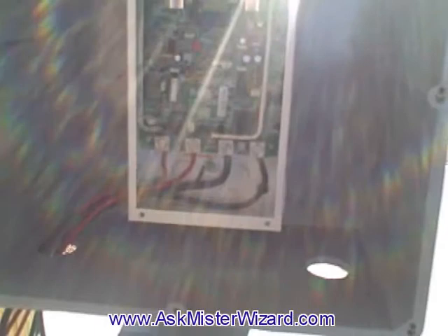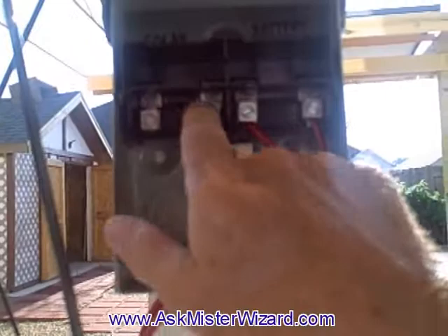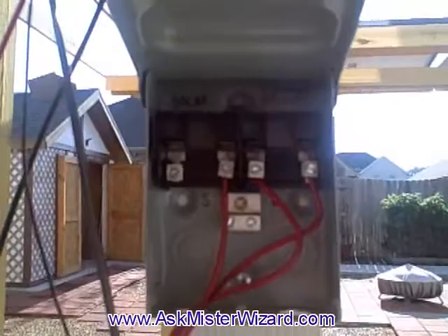Five minutes later, one more wire added and we're almost done. I just added this wire, which goes down to this side of the fuse, so we're going to be ready to route energy from the solar panel through the fuse and back up into the charge controller. With the fuses removed, there's no connection, so I think I can safely wire the remaining power connector from that last solar panel and string the last long wire. I won't actually connect it up until it's dark.